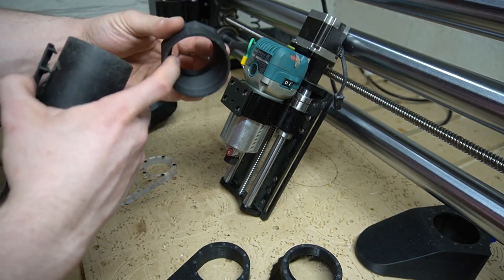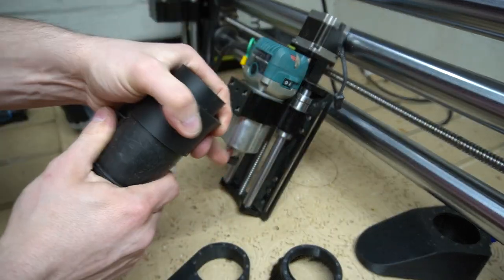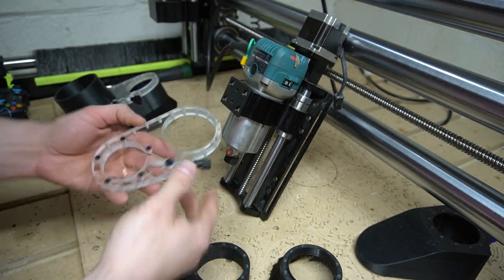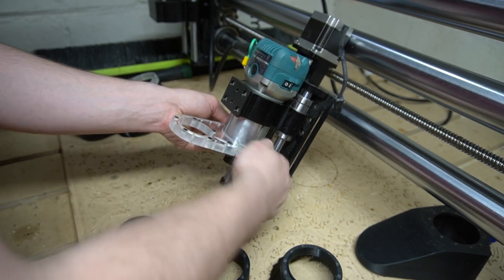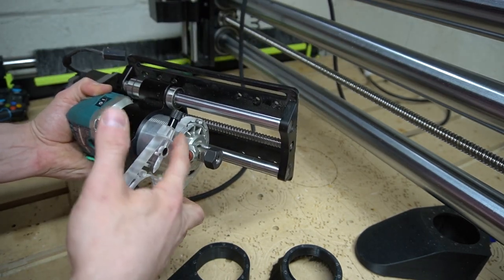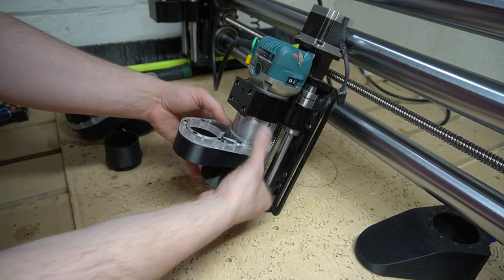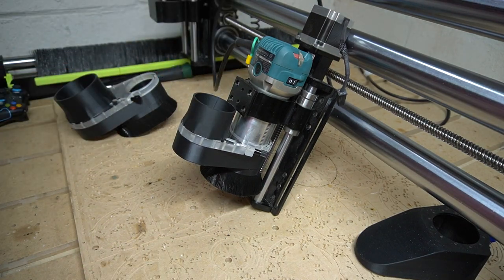There's a little ridge inside the hose port. You just push it on, then push it down and turn, and it locks on there really tight. You have the acrylic piece — the magnets will be facing upwards — and you just take this and mount it flush with the bottom of the Makita router. What I mean is you mount that metal piece and the acrylic flush to each other. Then you take the bottom and slap that on, add your brush rings, then your hose port. And that's all there is to it — you just install it like that.